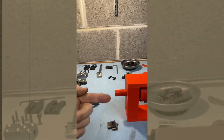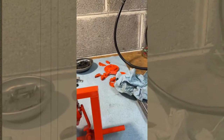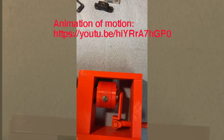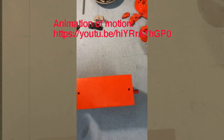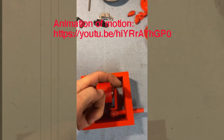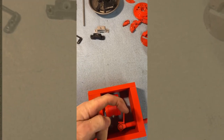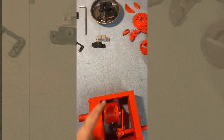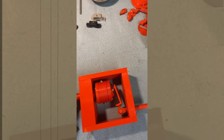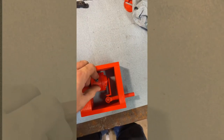So this would be the shaft that comes in from the motor. It rotates and then there you have the output shaft. This part right here, as it comes in, has a ball in there. And this screw goes all the way through it and you can screw it so that it goes left and right. What that does is it changes the angle that this is bent. By changing that screw, you can change the angle at which it's bent. The more bent it is, the more this thing is torqued one way or the other. And as it rotates, it will have a greater swing. What's nice about this is that with one rotation you can change your stroke length. That's a really nice feature.